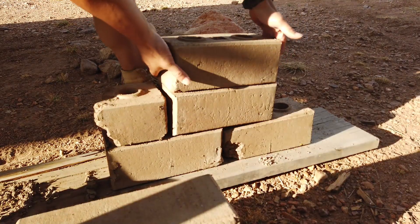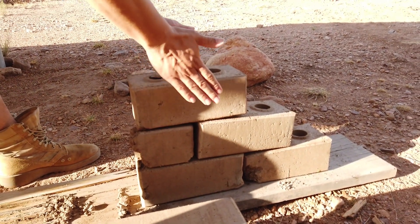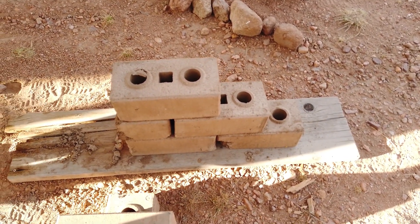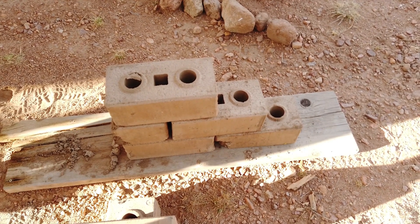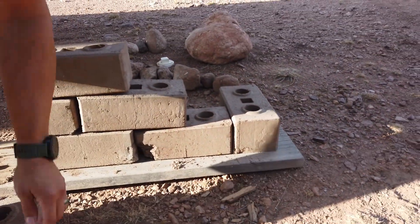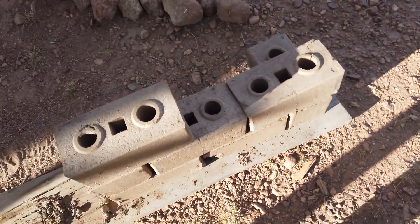But at least you get the idea of how it's going to go. If we can get a consistent block, then we can end up making our house like this. The goals are: one, it's unique; two, this is a lot of earth mass so it should be pretty good insulation; and it should act like a thermal battery. When it's cool in the morning it absorbs the coolness, and as the day gets hotter it releases that coolness into the house. As it gets colder in the evening, it releases the heat it absorbed. Even with some inconsistency in the bricks, we can deal with it and it should get better as we continue to work.